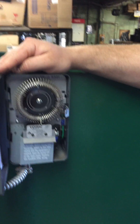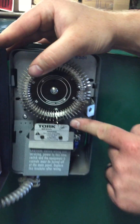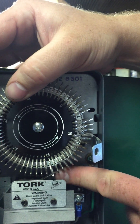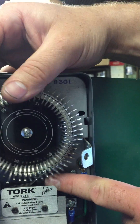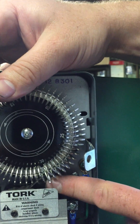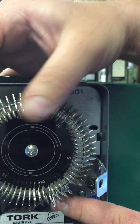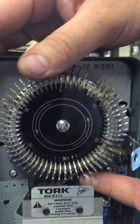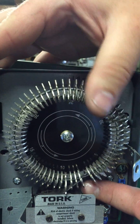Show them where the relay is that it closes. Right down here is a little switch — kind of hard to see. When the pin comes down to six o'clock, it pushes a little metal flapper down and makes contact. Now the big primary motor that runs the gear unit and the blower kicks on and runs for 30 seconds, feeding coal and blowing extra air.